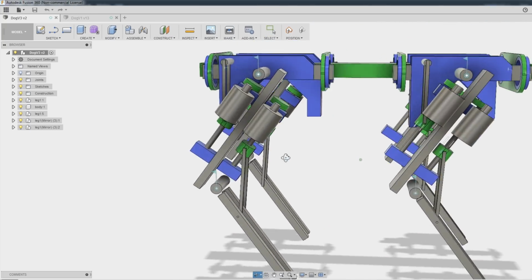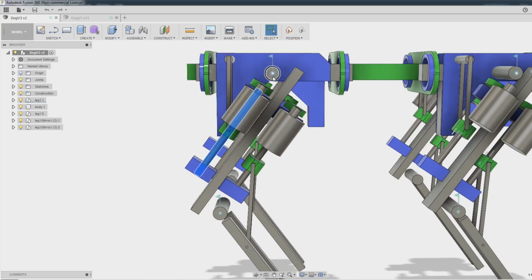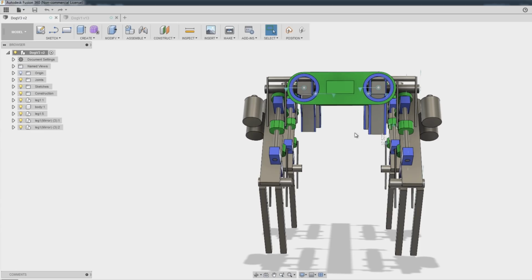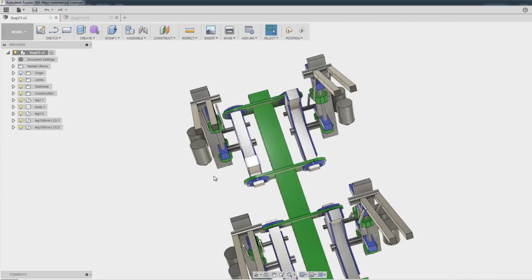I've also done the same with the upper leg there, so you'll notice again that pivot for the shoulder, or the top of the hip if you like, is in line again with that ball screw, and again we can see that joint in motion. Haven't quite decided how the other one's going to look, but it'll be another ball screw pushing that stick and basically pushing those legs in and out, and those ball screws will lie in between the mechanisms there for each hip.